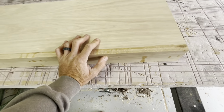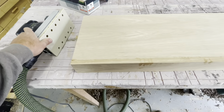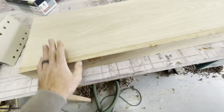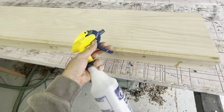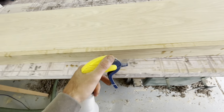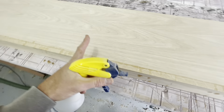I don't want to sand through the top veneer — these days modern hardwood veneers are only a sixty-fourth of an inch thick. I would typically sand with a more aggressive 60 grit to get the glue off, but instead I'm going to use 100 grit. It'll take a little longer but gives me more finesse with the top sheet. I'm also going to spray periodically with water: where the water doesn't get soaked up, that area needs more sanding. I'll mark that with my pencil, and typically I only sand about as deep as the pencil mark goes before checking again, so I don't go too deep and ruin the top sheet of the expensive plywood.